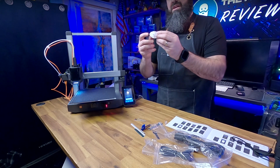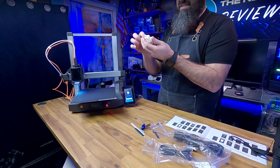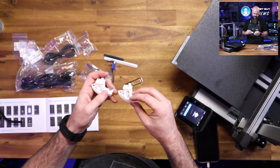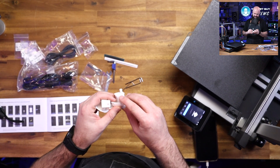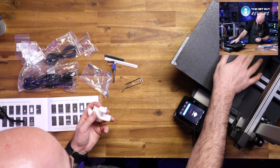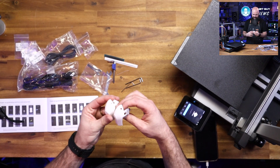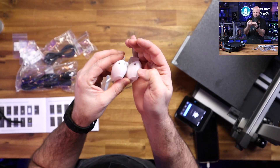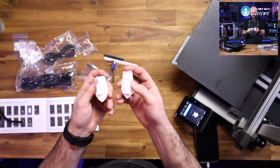It says 14 minutes there. Overall, very minimal stringing — there's a little tiny bit, but at 255°C, that's a lot. There's a little extra piece maybe right here that we don't have on the traditional Benchy. Here's the one to the left — this is a standard height. Quality is very similar. This one you could tell was going for speed, but there's a little extra piece of filament stuck out at the top, and I'm not sure where that came from. Plus my machine's over here oozing right now. You can see the filament didn't quite get it all out at that speed. In the beginning when this was printing it missed quite a bit of material on this corner just because it hadn't loaded the filament completely.